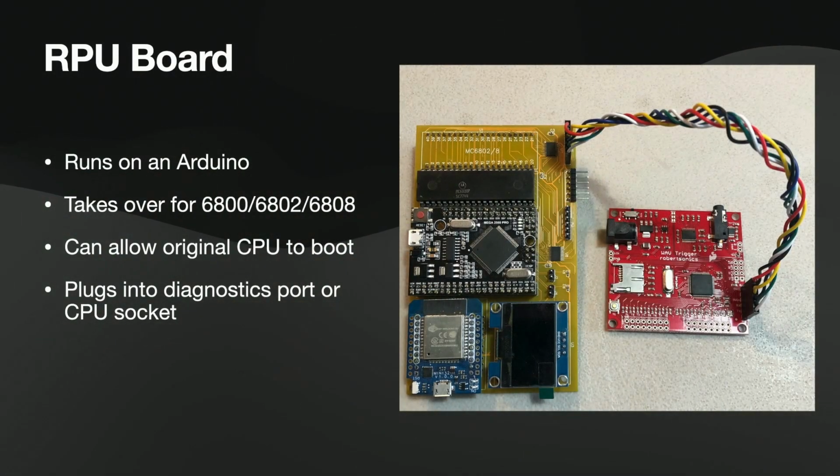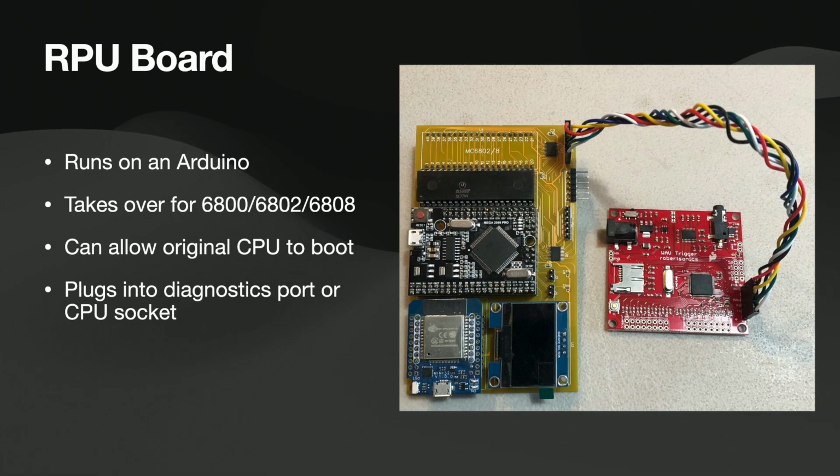And then the one thing I put in almost all machines now, because sound is so important, is these little WAV Trigger boards. That's a little board you can get on Amazon. You can get it a number of places. They're about $50, $60. It's kind of pricey compared to the rest of the project, believe it or not. But those will do all your digital sounds. It's that little red board in the picture. So you plug your speakers into that. You have to add speakers. And then you get background music. You get call-outs. You get sound effects. You get anything else you want to add to the machine.